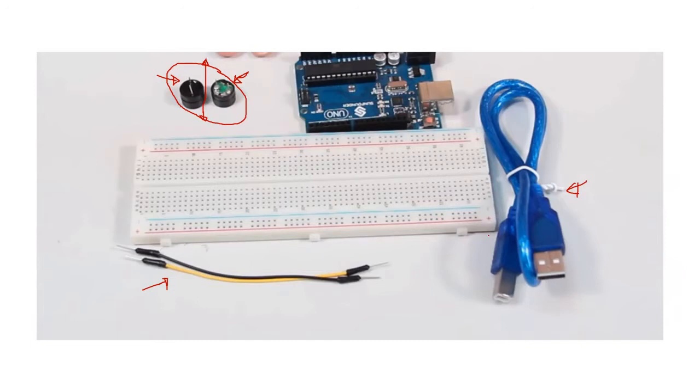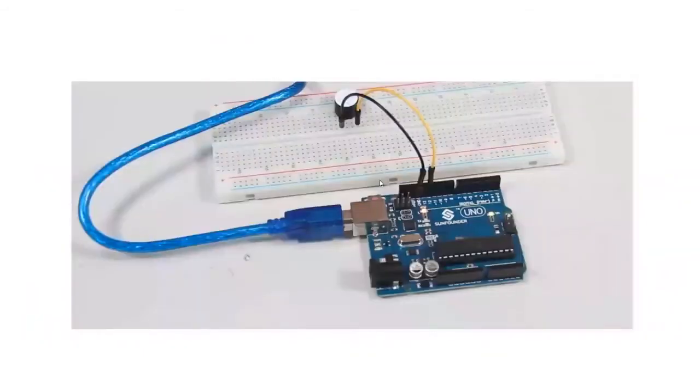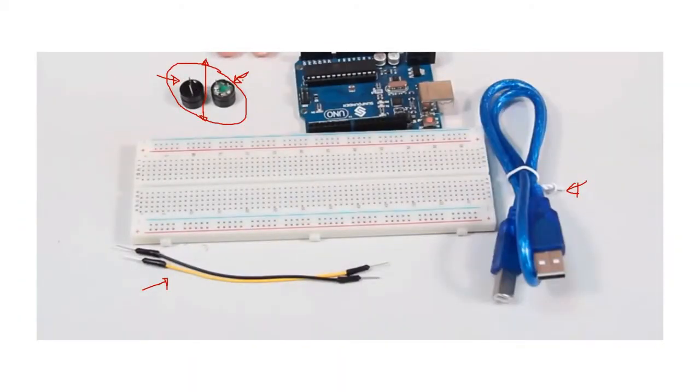Let me take you back again, and you can see this. There are two types of buzzer. We've talked about the one where the base is covered and the one where the base is not covered. The one where the base is covered is called active, and the sound is a bit annoying, because it makes a very clear tone. The passive one is not as annoying. It has probably just a click sound, just a click. So whenever there's a problem, you'll always hear some sort of sound like that.